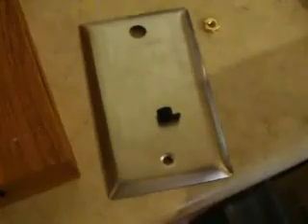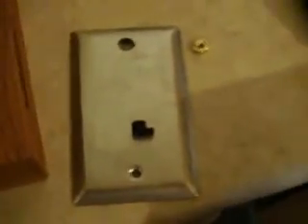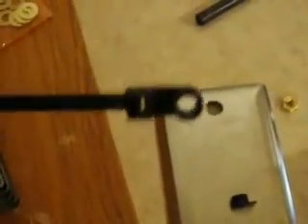We'll use that to access. What we're going to use is six of these little stainless steel electrical box covers — they work quite nicely. What I've done is I've drilled out a hole big enough to fit a little plastic spacer so we can insulate each plate from the other, insulating the negative side from the positive side. If you can't find any little spacers like that, I ran across these tie wraps that have a neat little hole in the end of them. They're not very expensive — they come in packs of about a hundred. I just took some snips and clipped off the little hole end, and I still have a good usable tie wrap.